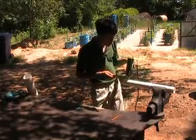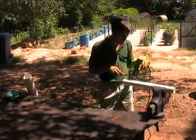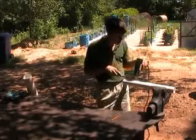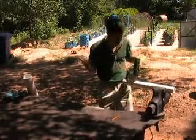If you have a die grinder with a little stone on the end, you can grind out the plastic a little bit when you're done. You can cut the hole a little bit small and then grind it out so it'll be perfectly straight. If you don't, or you just want to be a little bit sloppy about it, then you cut a little bit outside the line so that it'll fit in here.